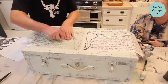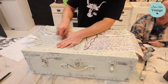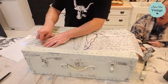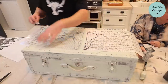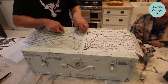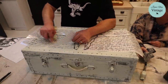Words are the most difficult part of a transfer. If you were doing this correctly, you'd wait until it dried all the way, put a coat of sealer underneath, wait for that to dry, and then apply the transfer. I'm getting some chipping around the edges — that's actually awesome; it means stuff that wasn't going to stay anyway is peeling up. Marlene: I would not use sage green background underneath Marie Antoinette — I'd paint it white, because the paper is pale and you'll lose detail; painting it white really brightens up that transfer.